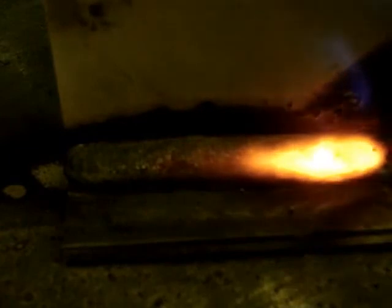Heavy slag coating here. I don't have enough arc force to push it out of the way. I'm using a lot of rod angle, mainly because the camera's in my way, but actually it helped on this to push the slag out of the way. You'll see the finished weld in just a minute. Came out pretty decent, but it wasn't hot enough at all.